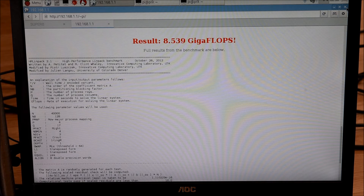However, I did hit two problems during the test. First, several of the Raspberry Pis detected a voltage drop below 4.65 volts, so they started running at half speed. And second, all of the other Raspberry Pis got up to 82 degrees Celsius, at which point the processors were throttled. Once I solved my power supply and overheating problems, the test should show better performance.